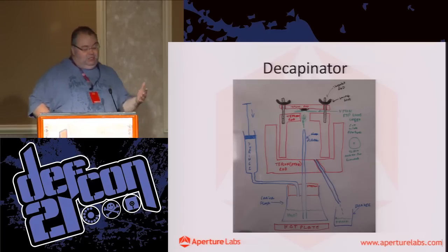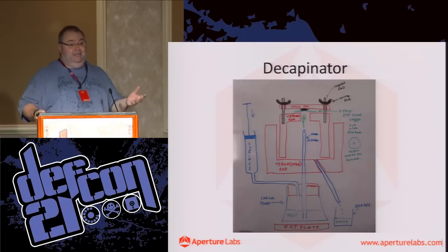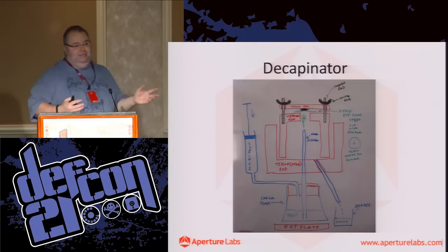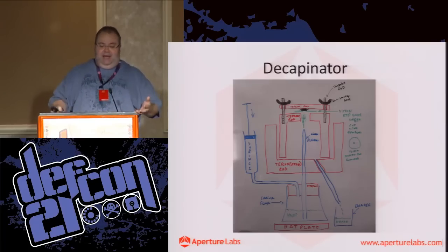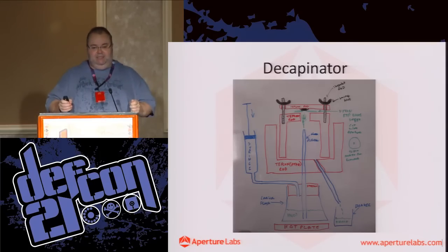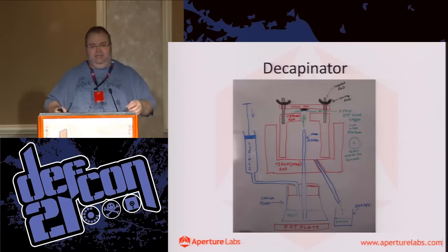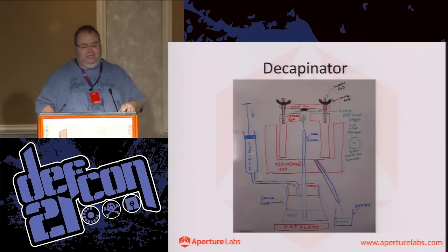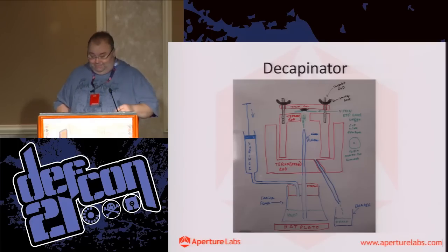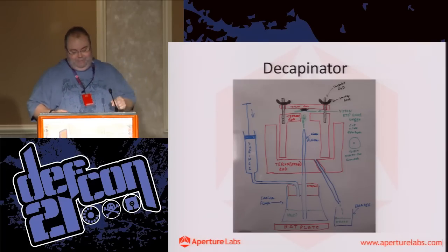And I realized that actually the cheap stuff works because I'm only exposing it for a reasonably short period of time. The Viton ETP 600 is designed for making gaskets for pipelines that are pumping nitric acid and stuff like this. When you look at the specs on how they test this stuff, it's like, okay, we're going to immerse it in nitric acid for 24 hours. And it's like, oh yes, and it expands 5%. And it's like, okay, that's fine. It's going to be nowhere near 24 hours. And even if it did expand 5%, who cares? Not with the stuff that we're doing.